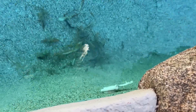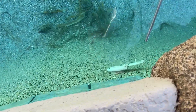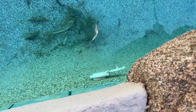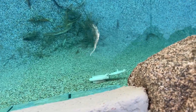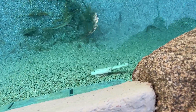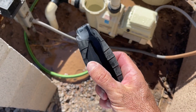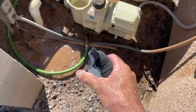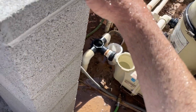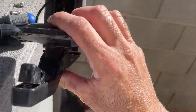Once all the debris is out, you're hitting pipe and you can feel how hard it is — that's how you know when you're done. I actually broke my drain bladder on this job; I think it was about five years old and it just gave out. They do make drain bladders that are not the rubber kind — they're a braided fabric, kind of like a fire hose material, and it's a much better, higher quality one. I'm going to get one of those next.